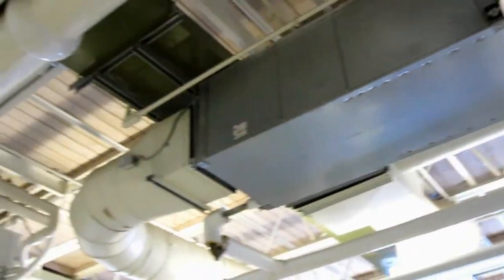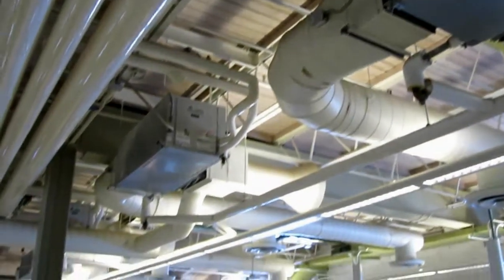If you look at any of these units, you'll see throughout the campus these water-to-air heat pumps. There are 59 of them in the ceiling around here. They vary in tonnage from 2 ton up to — I think the biggest one we have is a 10-ton in the greenhouse — but most of them are 2 to 3 ton. One ton is 12,000 BTUs, so 2 ton is 24,000 BTUs, 3 ton is 36,000, and so on. That's what we'll provide in heating or cooling.